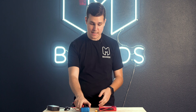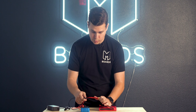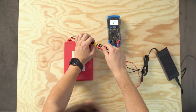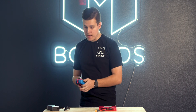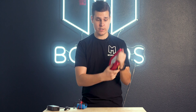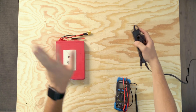You need to be able to test the voltage of all your different components. I'm going to insert the probes into each end of the XT60 to get a voltage — it doesn't matter which way you do it, worst case you'll get a negative reading. My battery is reading at 34 volts, which is a healthy number but not fully charged. For a 10S battery, once it's fully charged it should read 42 volts. It should match the voltage listed on the back of your charger. After a couple hours of charging, it should read 42 volts, give or take a volt.